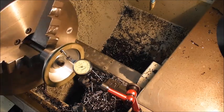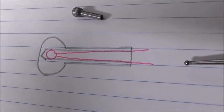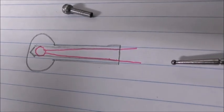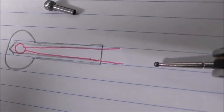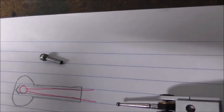That's not as big a run-out as the actual body, but still it's a couple of thou — about five hundredths. Looking at the dial indicator cover: it doesn't need to be anything flash because you're only going to get flats worn on it anyway. It's just a little sleeve with a hole in the middle. There's a sectional view of it — it contacts on the ball of the stylus down in the depth and pinches on the taper up near the end, so it's contacting at two points. Seems to work really well. I haven't bothered polishing it into a nice sphere because it's just going to get flats worn on it anyway.